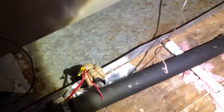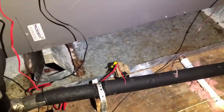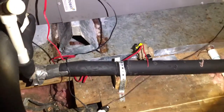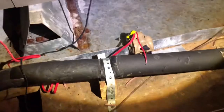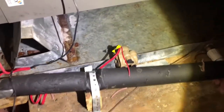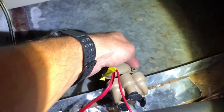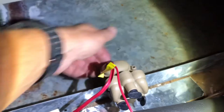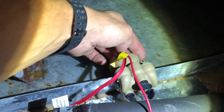The blockage has been cleared and the water has since drained away. What I'd like to point out is that there was a system here. This little device is a float switch — there's a little floating device inside that when the water rises it causes it to float, and when it gets high enough it turns the AC system off.